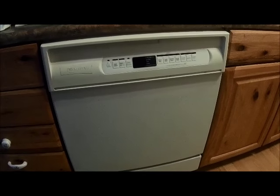Now we're living in the lap of luxury here at this particular cabin. We have a dishwasher, and you have to make sure that you get that as well. So I've poured in some antifreeze within the dishwasher itself. And then on the dishwasher setting, there's a drain. All I'm going to do is press that, and it'll, you know what, I've already turned the power off to it. I'll turn the power back on. But I press that, and then that'll drain the dishwasher, and it'll put antifreeze through that trap as well. So if you have a dishwasher, don't forget about that.